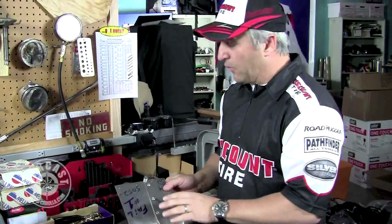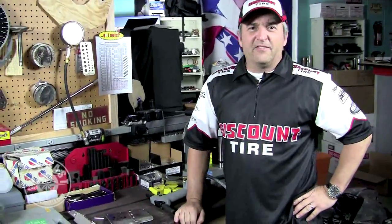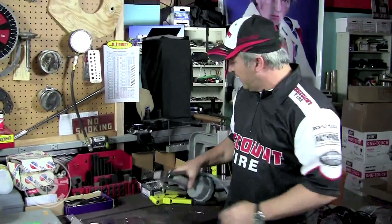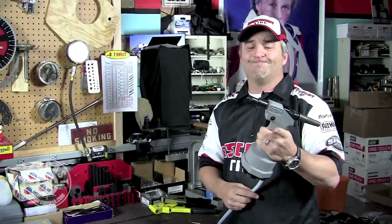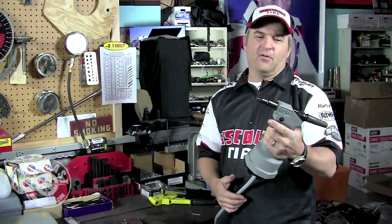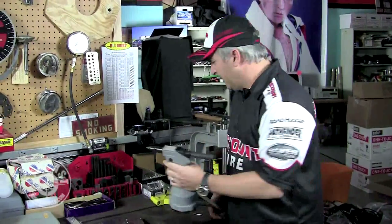Add them to your toolbox if you're doing any sheet metal work or building things where you need to do pop riveting or alignment before you drill all the holes. This is a great kit to have. Sheet metal guys use them to align panels before they bond, drill, weld, or whatever. And then the variety of pop rivet guns — my favorite is the air pop rivet gun, because anything that makes that kind of noise and has a trigger has got to be fun to use.